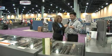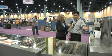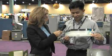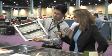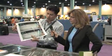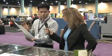This device also slits, cuts and creases, but what's different is we're now offering an inline folder attachment. So we can do slitting, cutting, creasing of cards and folding at the same time. And you can see here we're doing multiple cutting and creasing, but this folding device is where it shines. The product is now completed with the folder attachment. This is our invitation, printed two up on any digital print device. The nice part about this 645, it reads a barcode which identifies the job program, sizes up automatically, and it just does its thing.